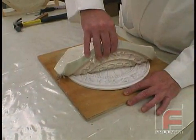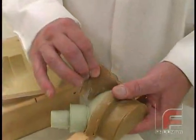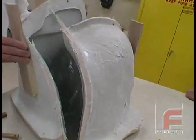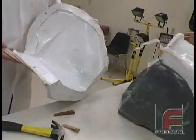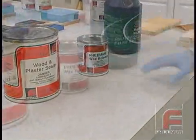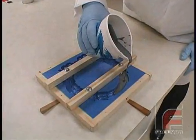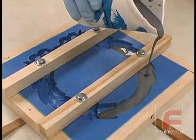One of the most common frustrations in making molds and casting parts comes from parts sticking to molds. This is the number one source of problems cited by toolmakers, and why we constantly investigate newer and better ways to seal and release models and molds to ensure easy part release. And nothing yet has matched the following combination of Freeman wood and plaster sealer, Freeman wax release, and Part-All PVA mold release, with a notable exception of casting a urethane against a urethane, which we'll address at the end of this video segment.